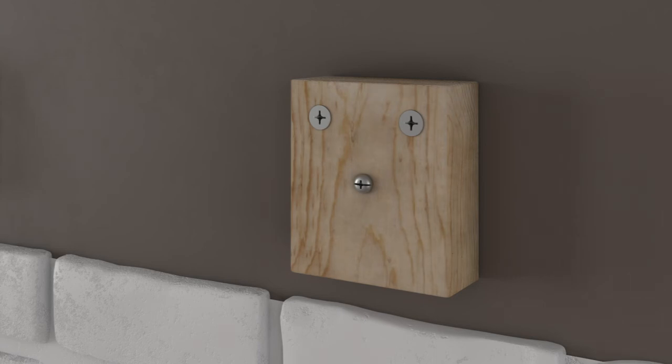Lightly mark the center of each mounting block or 2x where holes were drilled, top and bottom, on the wall to align where fasteners — one and a half inch trim screws — will attach the beam mantle to the mounting blocks or 2x.